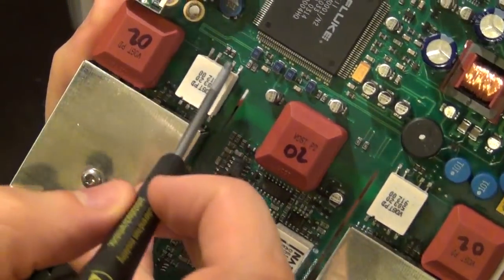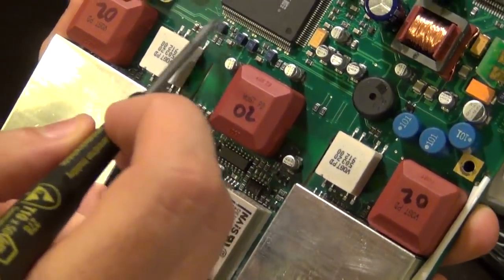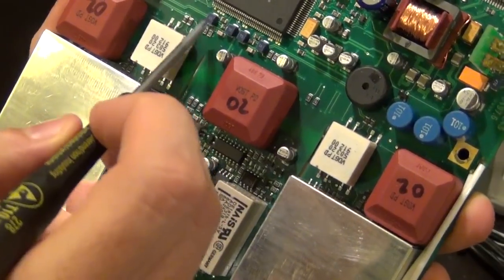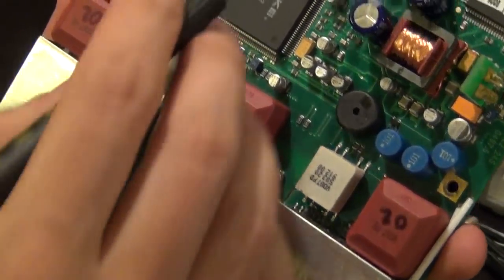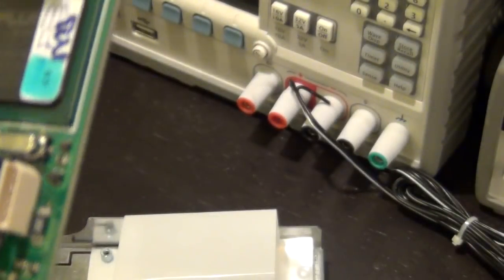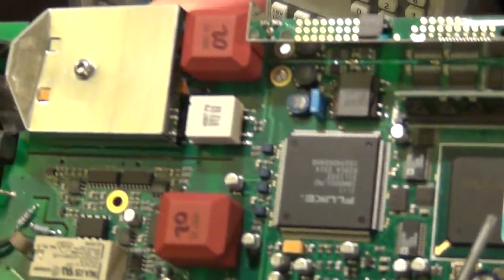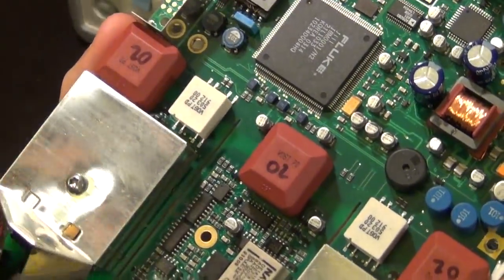There might be some impedance matching passives here, some other more passives probably again to have the impedance matching or to condition the signal. So therefore your ADCs must be in there. So this must be all the DSP in there. Actually, it has some label on it. It says Spider something, but it's now covered by this. It's the name of their chip, I suppose. And again, more transformers, these orange ones or the red ones.